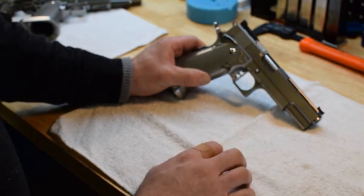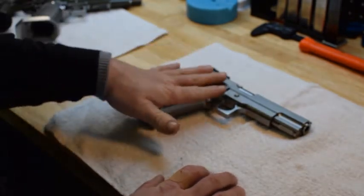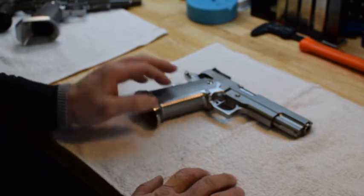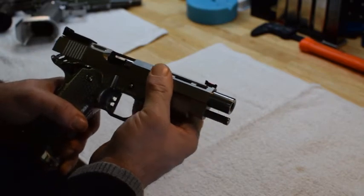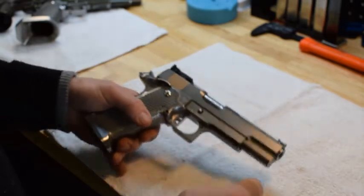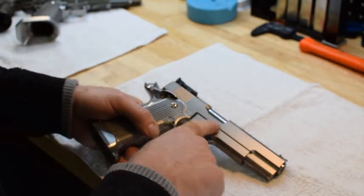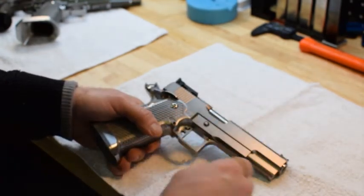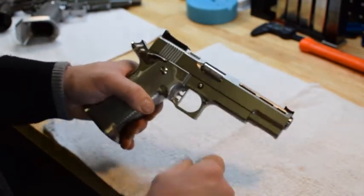So there's your gun coatings. If you're buying a high-end gun, make sure you get one of the better coatings — PVD or some kind of plating — and make sure the guys know how to do it right. A lot of times you'll see plated guns come back so tight that they just don't work the way they should. When you plate the slides and frames it adds material and the corners get sharp again — we break all the corners before the guns go out. So you have to break all those corners back when the guns come back, and that's what makes them run super slick.